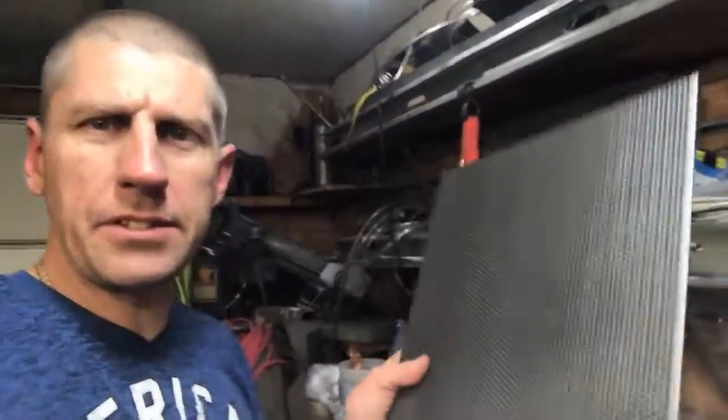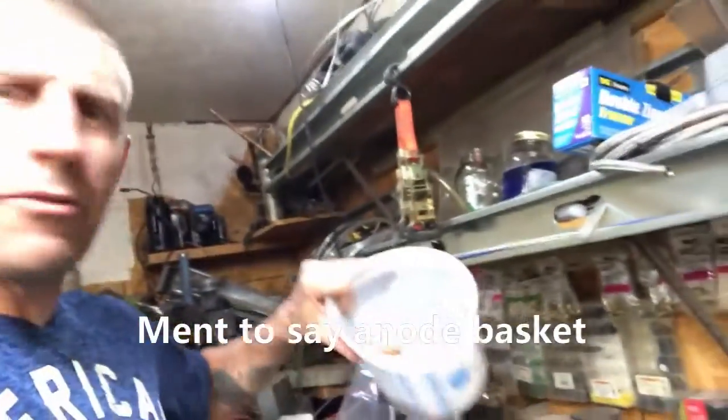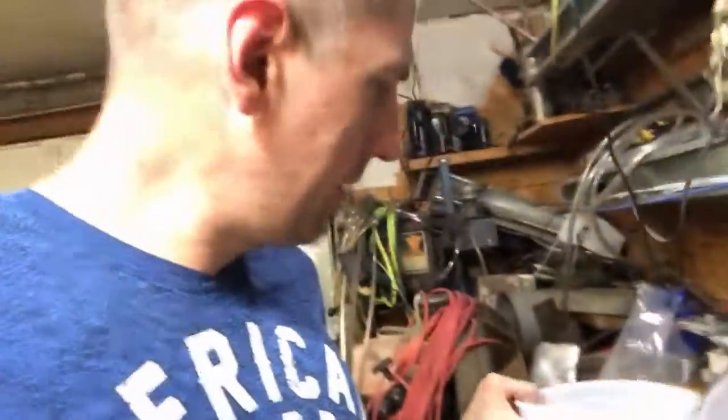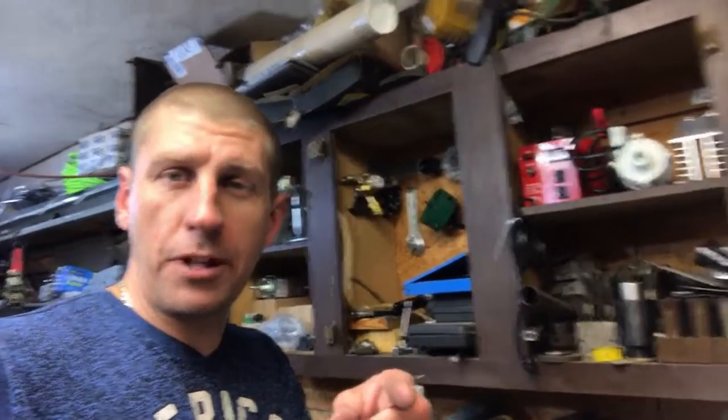I've got some chemicals and I'm building an anode sack — I have the metal for that. This is the stainless that we're going to be using to build the anode sack, and that is where the metal shot will go. We'll be throwing stuff like this copper shot — it contains the precious metals — into the anode sacks, which will then be digested into solution and electroplated onto collector cells.